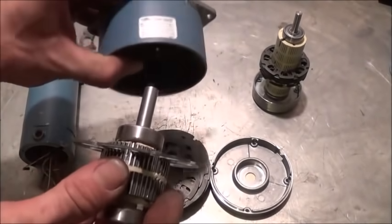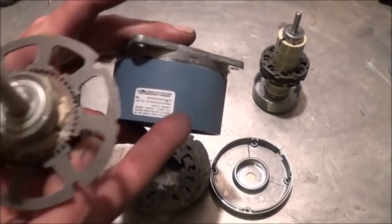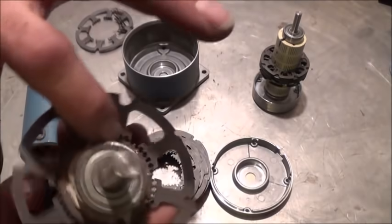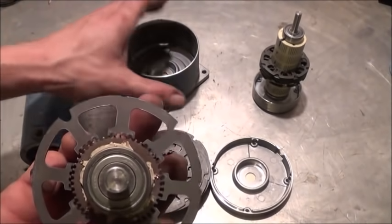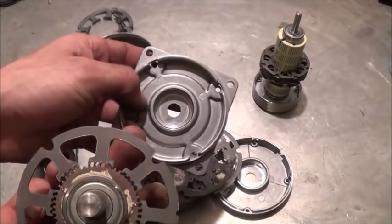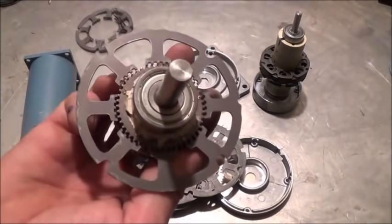Once we're done with that, we're going to put this all back into the case — the original stepper motor case. We're going to drill some holes for the air input and the air outputs at the centers right around where the bearings are going to be. The outer rotor right here is going to be right about where the air output holes for this engine are going to be — right around that outer ring that holds the bearing. And we'll put an air input into the side of this outer case just like that.